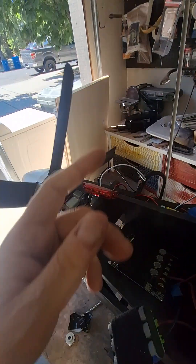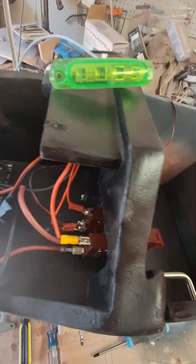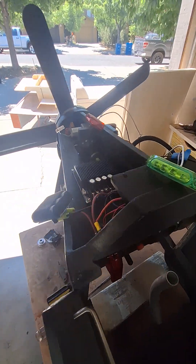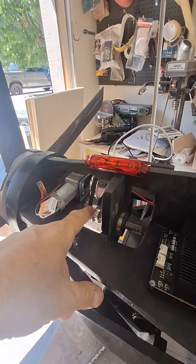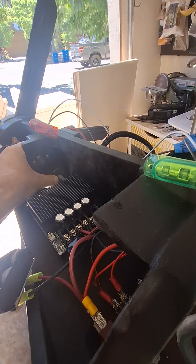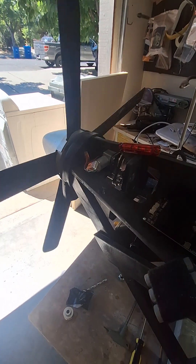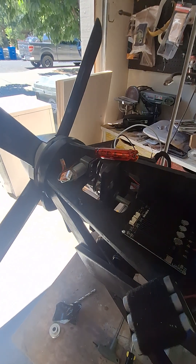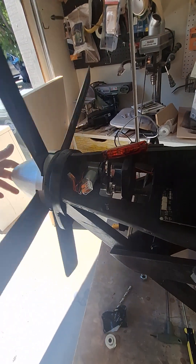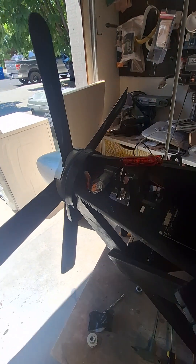I wanted to explain this — this is my version of what I call a clutch system. Because it's electric, I don't want this spinning crazy fast. I don't want this propeller going really fast. These are plastic blades and might hurt a kiddo. So what I did is I came up with this. The idea is that this belt fits so loose that if I grab it, it will stop this system. You can see this motor has a lock — it will not spin freely when it's powered off, but I can still turn the propeller. So when this thing's spinning, that's spinning. Kid jumps in front of it — the motor might still be working, but this won't spin. That's a safety feature I recently came up with.